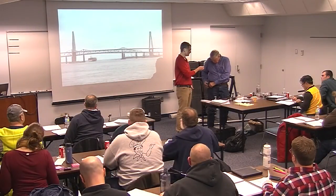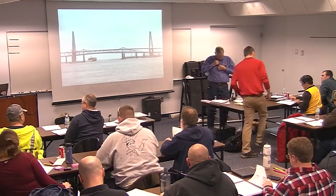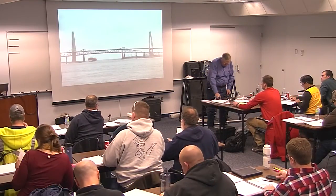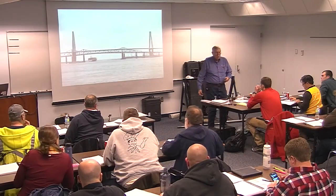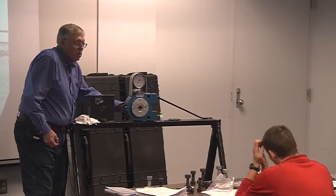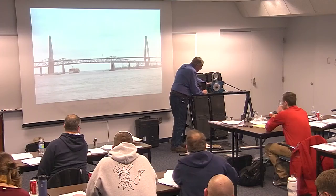Brian said we weren't going to do pre-installation verification, but I decided I ought to do that for you, just to give you guys a better feel for it. I've got a 7/8 plain bolt here, 4 1/4 inches long. So I have to do a half turn on this for installation, right? It's greater than 3.5 inches. I'm going to do one pre-installation on turn of the nut, and I want to do one on DTIs.